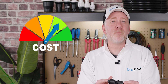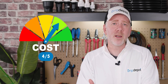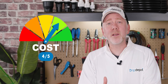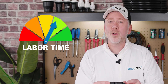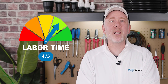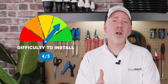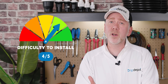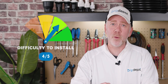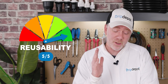Cost: 4 out of 5. These do cost a bit more than a compression fitting or a barbed insert fitting up front, but they are always reusable, do not require any additional purchases, and their quality means they'll last a very long time. Labor time: 4 out of 5 — once you've installed a few, you'll get used to the process and it can be completed pretty quickly. Difficulty: 4 out of 5. Getting the Permalock on does take some elbow grease, but nothing like a compression fitting, and no additional tools are needed — just a locking nut screwed down over the fitting. Reusability: 5 out of 5. Permalock fittings are completely reusable.